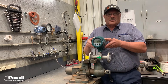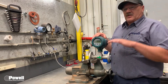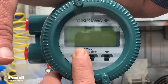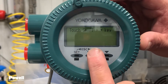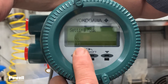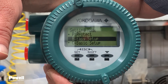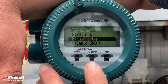Next, I'm going to go through the menus of this transmitter and show you how to set up the simulation. To get into the menus for the Yokogawa, press your finger over this button until you see 'Touch Shift,' then press Shift and the Down Arrow key. You'll get a Yes or No prompt — use the arrow key to go down to Yes, then press Set. It'll start flashing; press Set again and it will go to the menus.